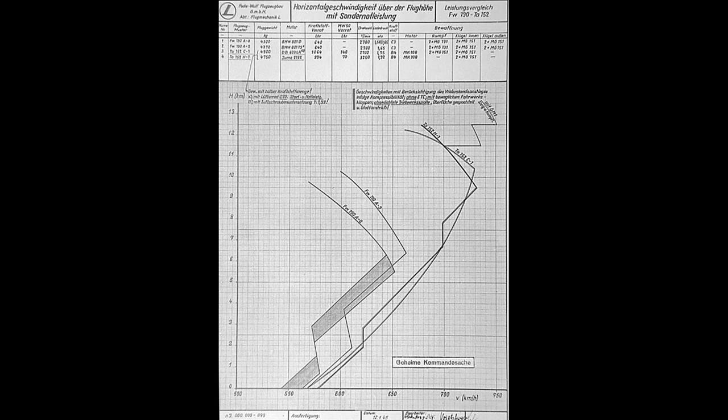The C model also has shorter wings, as I mentioned, which is better for low and medium altitude performance. It does not have the pressurized cockpit. The C model prototypes have the supercharger intakes on the left side of the cowling due to the different configuration of the DB603 engine. I think the C model had a lot of potential but was never fully developed.